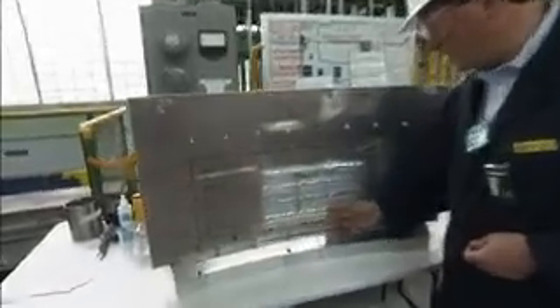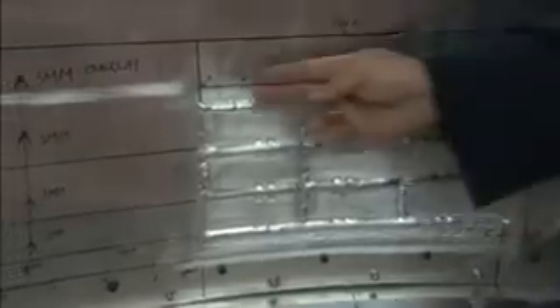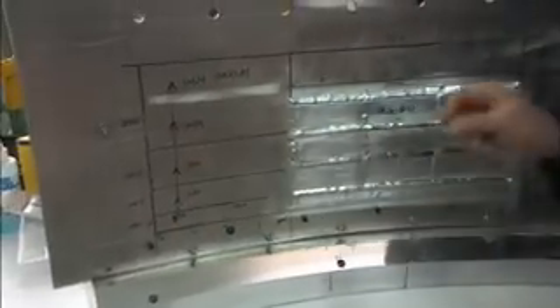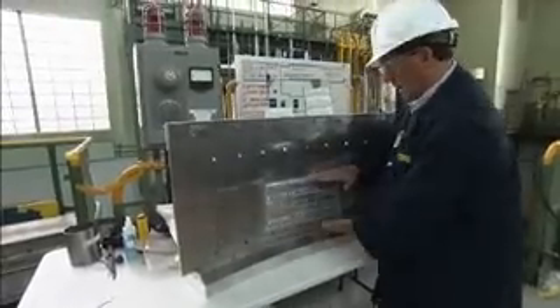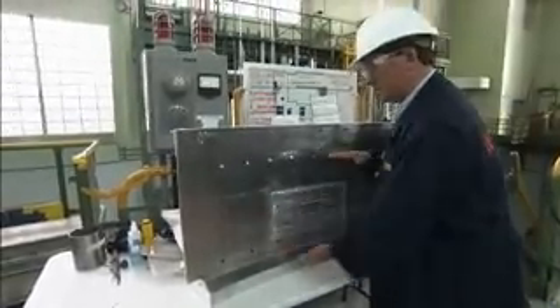This shows the horizontal buildup in a segment below. We have to build it up in this case to a four millimeter thickness. We'll apply horizontal buildup up here to four millimeters, like a window frame around these plates. And then finally, we'll do a thinner layer of buildup — three millimeters in thickness — across the top and out here on the side. That will be the final weld operation, so we'll end up with a combined weld buildup, an array of nine plates of this size.